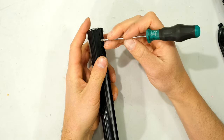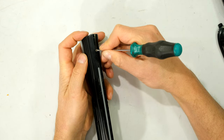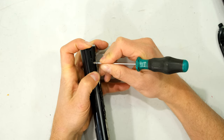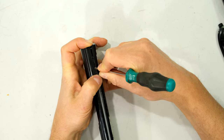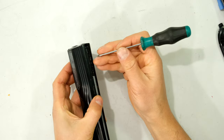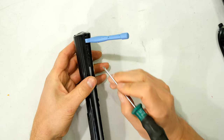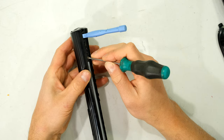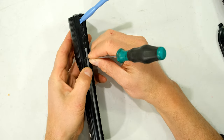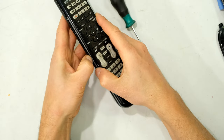I'm taking my screwdriver on the side, holding it quite close to the bottom, and just inserting it — it's already popped open. I hold it close to the bottom so the screwdriver does not go deep into the unit. I'm just lifting it along the seam. I don't want the screwdriver to go in too far because I'll damage the circuit board — that's why I hold it just at the edge. The pry tools come in handy here to hold it open while I go along and unhook the side. You can also slide your nail here to help.